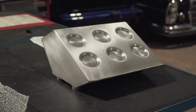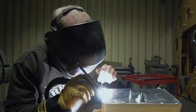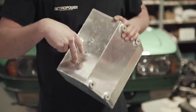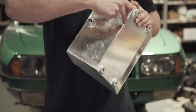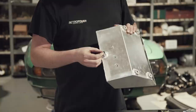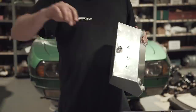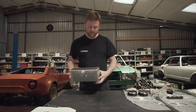Here's the tank we've fabricated — we've done the dimple effect just to make it look a bit more interesting and give a nod to that passenger footrest thing. On the underside there are threaded bosses done to the appropriate depth for the thickness of the carpet, bolted up from underneath. Two threaded bosses were welded on the inside before we welded the tank up — that's where the screen wash pump mounts. There's the outlet which goes to the screen wash pump with a tube on the inside picking up fluid from the bottom, and then a spigot that goes up to the fill tank at the top. This curious-looking piece here is a small tube that lets air flow out from inside into the top tank whilst you're filling, so it fills smoothly without glugging.